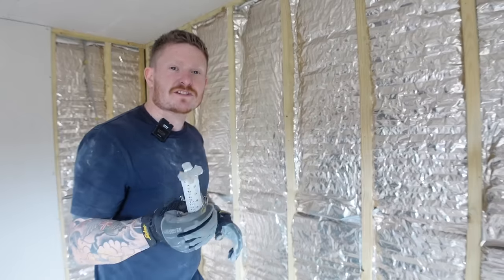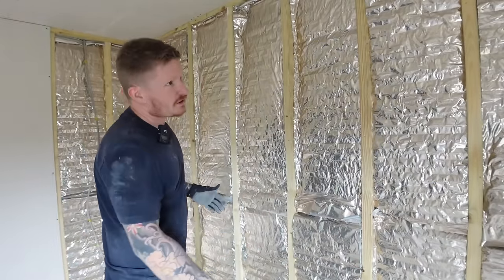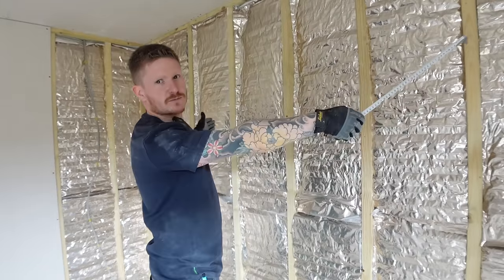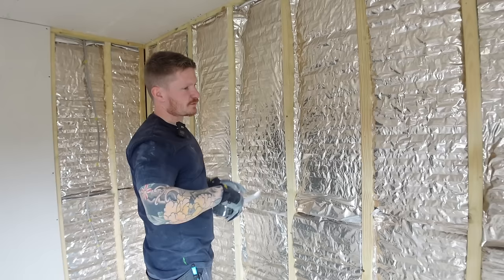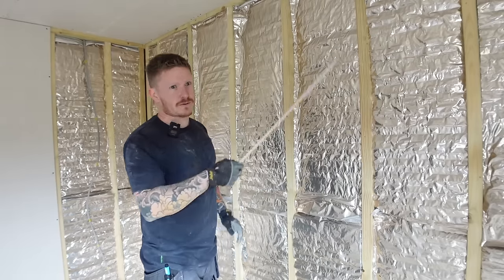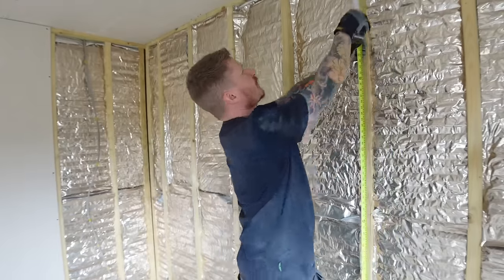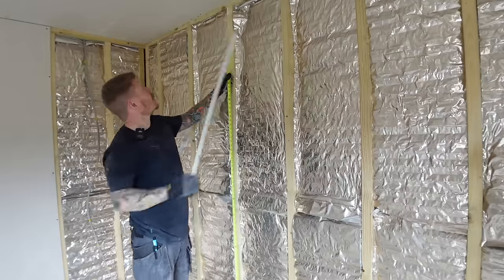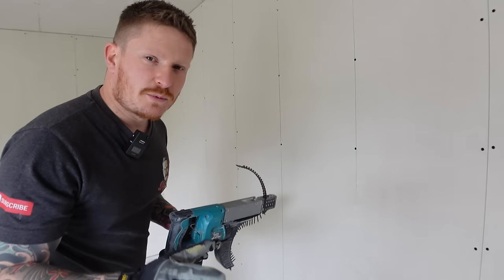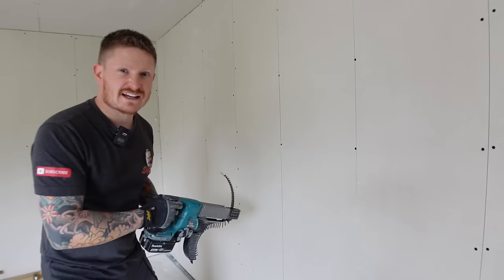Because there's a fall on this roof, when you're cutting your plasterboard this side of the piece will be taller than the other side. If you remember the fall is 20mm per metre, brilliant — if not, take two measurements from the front to the back of the board to work out how much to cut off the top. Now all the boards are up, I can just run around and put the rest of the screws in.